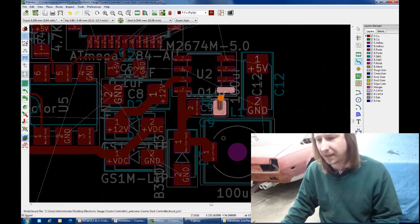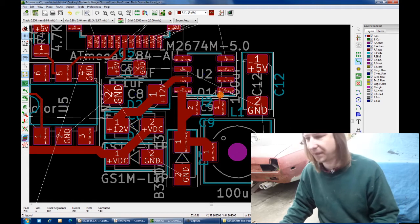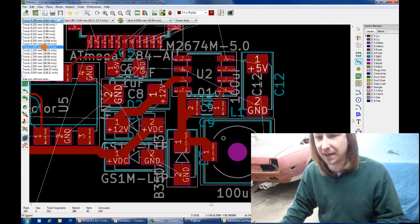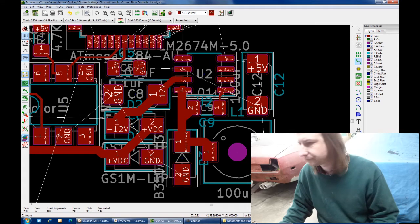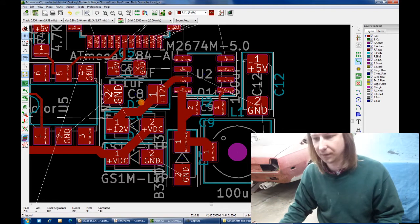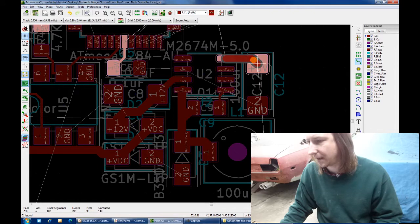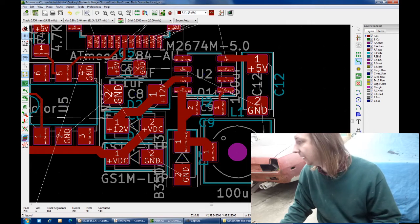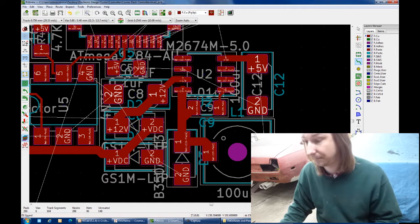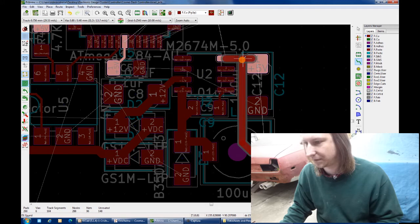I'm just laying out the power supply area right now, and it's worth mentioning that the placement of these components is really critical because it's a switching power supply. So not only do I have to put them in an area where the high frequency won't necessarily interfere with something else, but the traces have to be very thick to carry the power, and additionally I'm going to have to do a copper pour all over most of this area, which is going to envelop these traces anyway to keep interference down with the rest of the circuit. Because, well, 2 reasons. 1, typically that's what you need in a switching power supply. And 2, the data sheet of the chip was very, very specific. That is what's to be done.